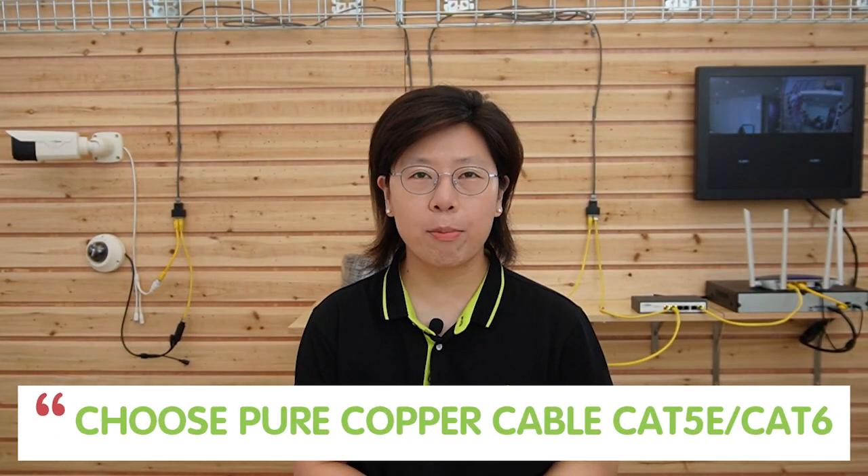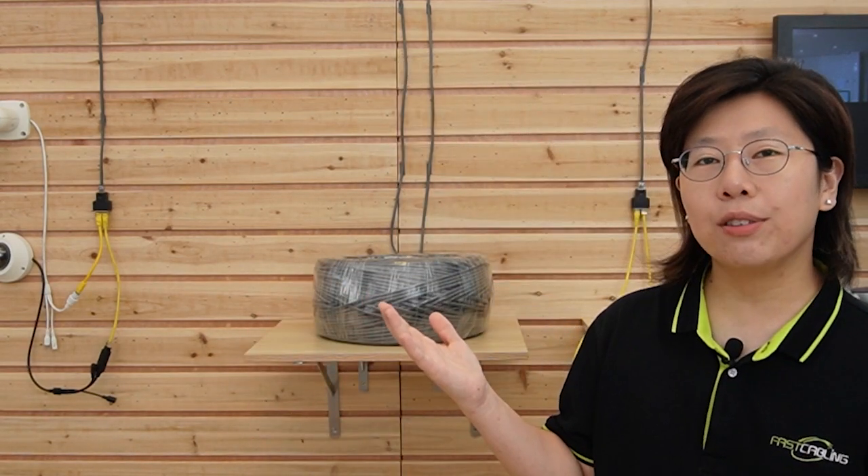When you set up a PoE connection, make sure you choose a pure copper cable like CAT5e or CAT6 — just like our customer's choice. CAT6 is great because pure copper has superior conductivity compared to other materials, providing stable PoE connectivity. Also, this long-range PoE port can support up to 500 meters with 100 Mbps data transfer rate when used with a PoE extender. It's also available in an 8-port version. If you're interested, here's a video on how to use the long-range PoE switch. Thank you very much for watching.